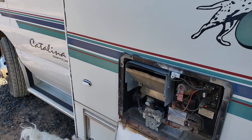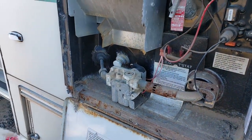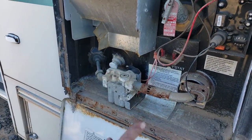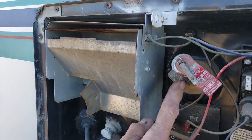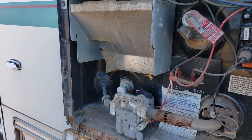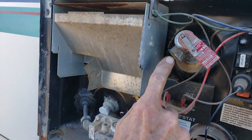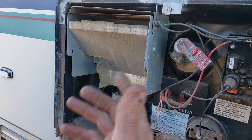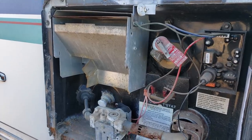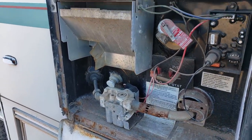Here's the heater. Did it work? How does it look to you? Fine — just dust it. On Debbie's, this is not an adjustable thermostat, so they get really hot. And on Debbie's it got so hot that this started leaking — that's the pressure and temperature relief valve. It gets too hot, it drips. Be careful with that. Get it filled up with water. If the pump's working, fill it up with water.